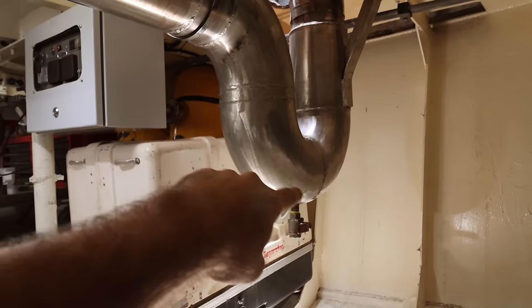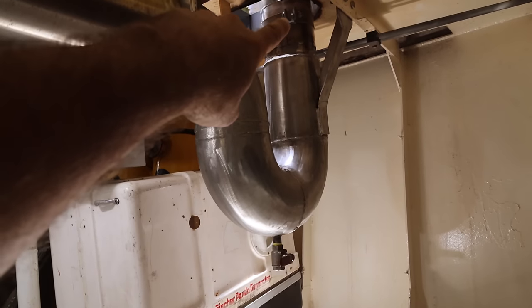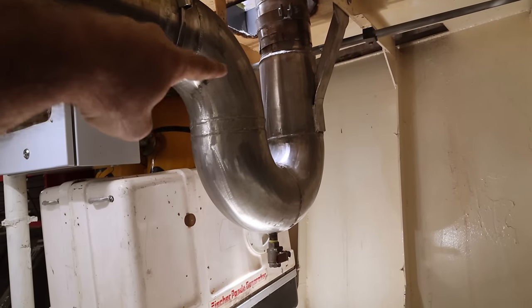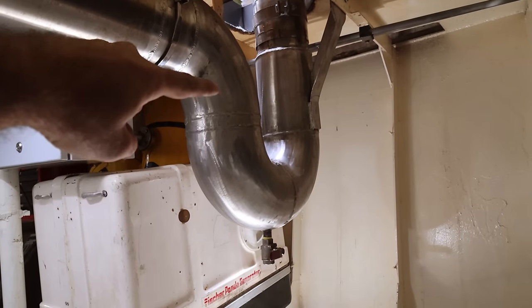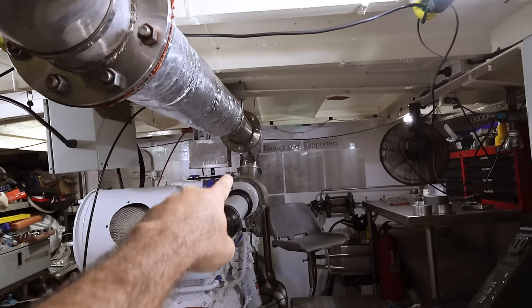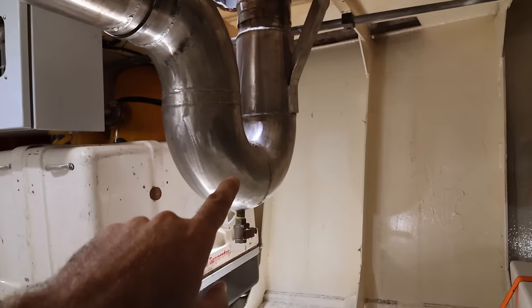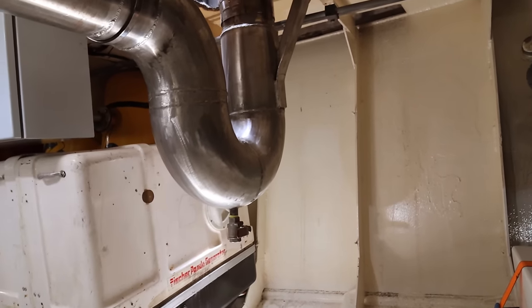This is the water trap for the main exhaust, and you can see this little ball valve just there. Any water that comes down the main stack gets caught in this big trap, and you can have a bucket load of water in here, about 10 litres, before it actually starts getting close to coming along this straight piece along the roof, and then down into the turbo. So it takes an awful amount of work to actually get water into the engine on Brupeg, which is a positive thing.